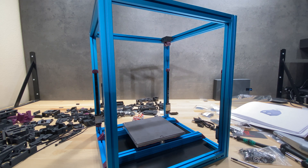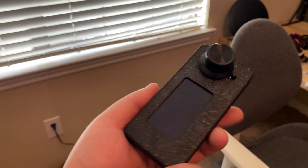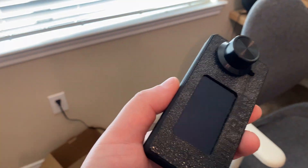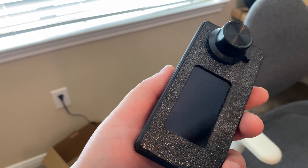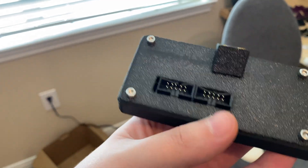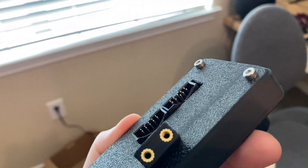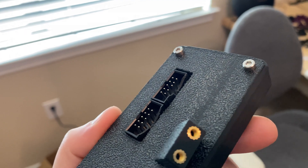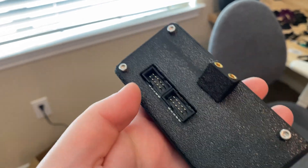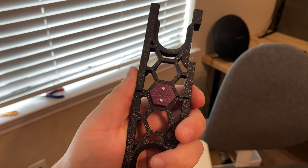Here is one of the things I'm doing that's not supplied with the DFH kit. I have a mini 12864 display — the one I used on my Voron 2.2 back in the day, and on the 2.4 as well. Since on the 2.4 I'm now using a Raspberry Pi touch display, this one was free, so I decided to use the mini 12864 for the Micron. I'll also need the ribbon cables for this — you can see the mod I did for those back in the Voron 2.2 days, because the pin orientation on the mini 12864 was different from the SKR 1.3.